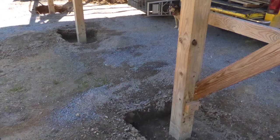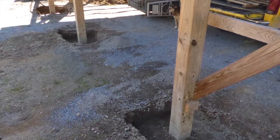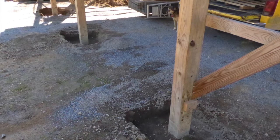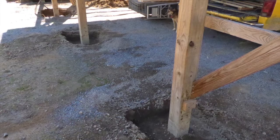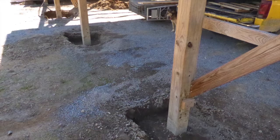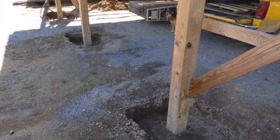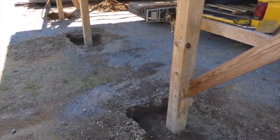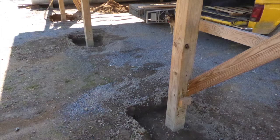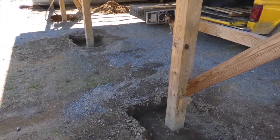The next thing done was to begin excavation around each post, in contemplation of the concrete floor soon to come. Each of these holes was hand dug with a shovel and measured for depth using a laser level. I wanted the concrete a few inches deeper around each post because that would provide more stability for the post and also ensure more overall building strength.